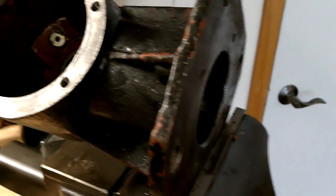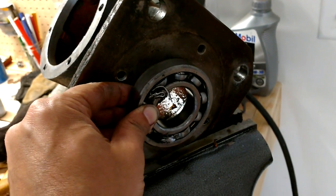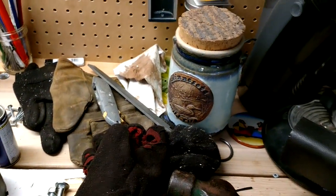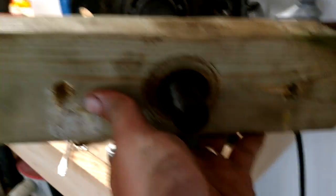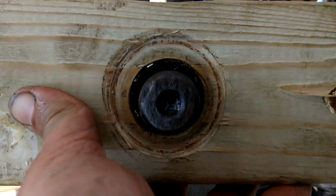You've got a bearing up here, a bearing down here, and a sleeve that sits in the middle. This bearing sits down here and they're pressed in like a typical bearing, so getting these out is the challenge. If you don't have a bearing puller, here's a real easy way to do it — get a piece of two by four and drill it out.